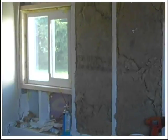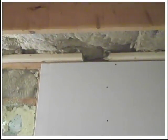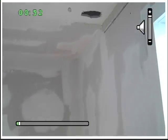Another one I did from the inside. And fix that 2x4 later up top. It was vibrating so bad it was driving me nuts trying to cut it, so I just pushed it off to the side. When I take the light off the top, then it'll fix the ceiling. I glued 2x4s up there to hold up the drywall with some 3X glue. Put Roxul up in there and press on. That's so we can see what's going on up there. That's the drywall started.